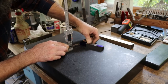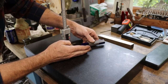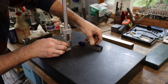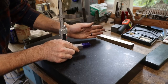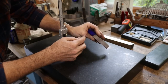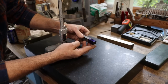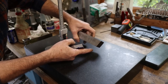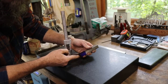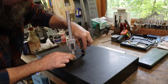Now I'm going to make the cutting blade slightly over half inch, maybe about 5/8 of an inch long, so I can part off material that is up to an inch in diameter. I'm going to make sure that I grind my parting blades on the chuck side of the tool. That way, I can part right up next to the chuck, and I'm also taking advantage of the end reliefs that are already pre-cut into these tool blanks. You can see that all of them, even this big chunk here, have reliefs cut into them. So taking advantage of the angle that's in the end of these from the factory just keeps us from having to remove that stock when we relieve the front. So that's the reason.